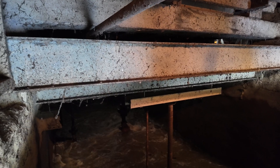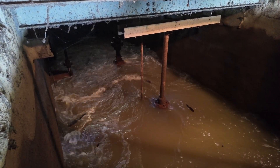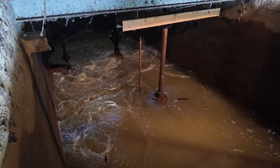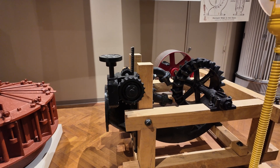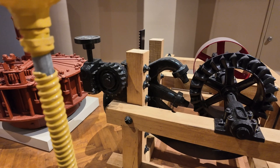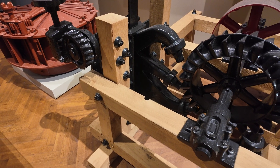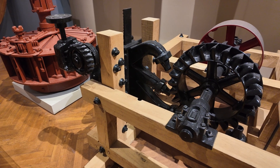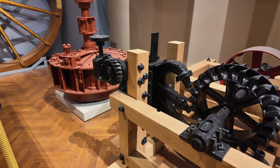The turbines are at the ends of the two thicker pipes here. The next innovation is actually right next to it. This is from the 1870s — American engineer Lester Allen Pelton developed the Pelton Wheel. This is an impulse water turbine, and you can see there are multiple jets which direct water into the cup-shaped parts on the wheel to turn it. It is designed to handle situations where you had high drops but not necessarily high volume, and it works pretty well.